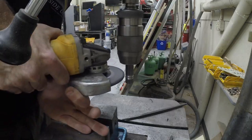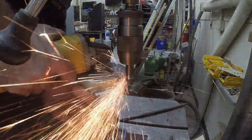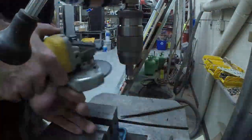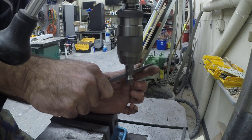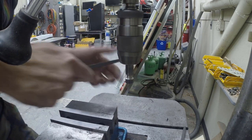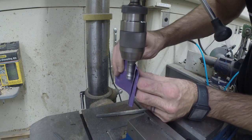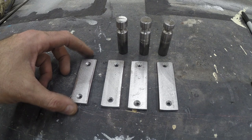This is just a standard metal grinding wheel used to cut out the middle. Then I'm going to use files just to clean up things a little bit — it'll help square off everything. And then the final step is just to use sandpaper, take off the burrs, get things a little more dressed up. I'm not trying to make a super perfect thing here, just something that's gonna work, but it'll get reused so I might at least do a decent job.